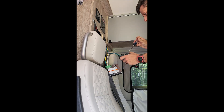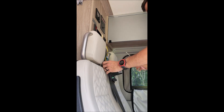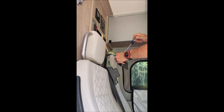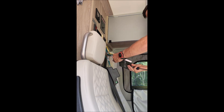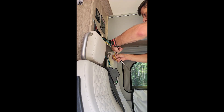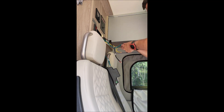I really like the way these fit into this new solar controller a whole lot better. And if you don't know, the reason I'm making this switch is because this old solar controller is a different type. MPPT is the new one — this old one is not that. And it actually limits the amount of charging your solar panel will do. I have the pop-top, so I have 220 watts, and it actually limits it to about 100 watts. So this is going to make a really, really big difference with my charging capacity for solar.